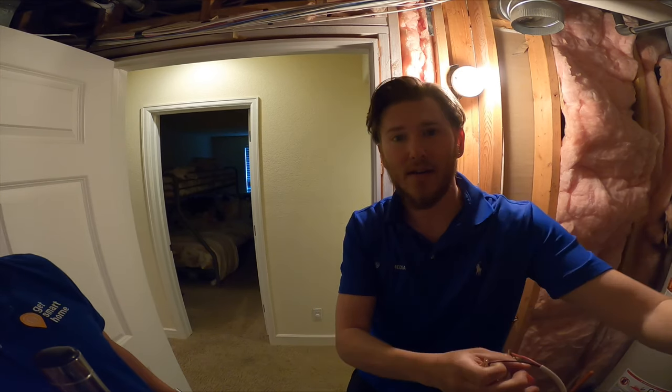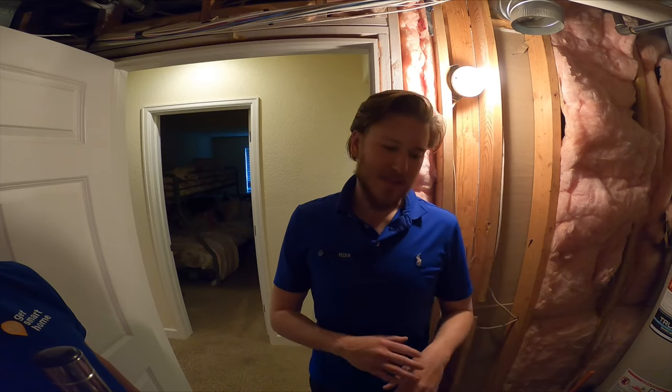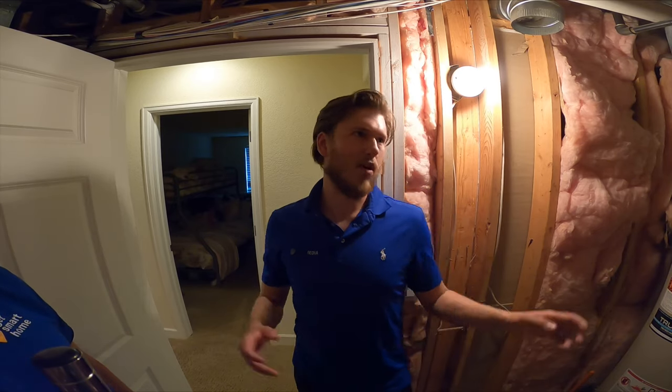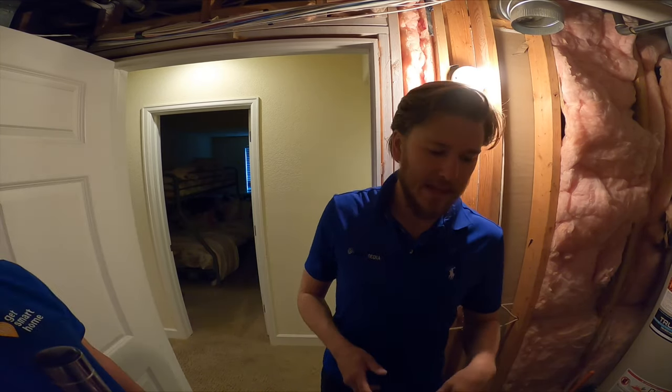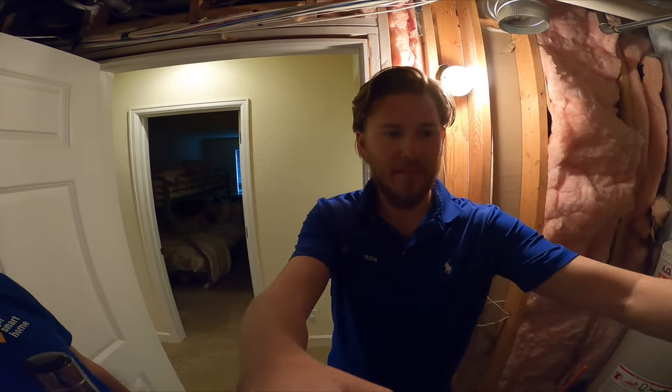And you can hear in the other room right now it making a tone. That's because this line is physically connected to a speaker, which is typically what we do. We'll go and connect all the speakers in a pre-wired room and then go and tone it out and mark out where they go. So I'll go show you real quick.